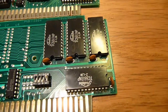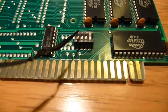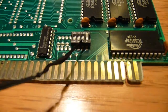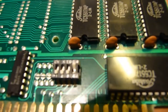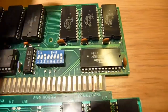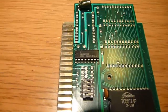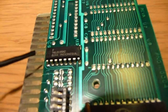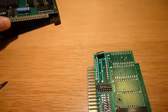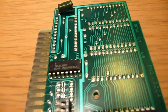With a few changes. This one has just four DIP switches. Checking on — off, off, off. On, off, off, off. That is pretty interesting. But why I doubt, like I said, that these are 16Ks — if we're looking at this, that little circuit — this one is not similar to this big one down there. Because this one is a dual one-of-four decoder, and it doesn't even have a demultiplexer.